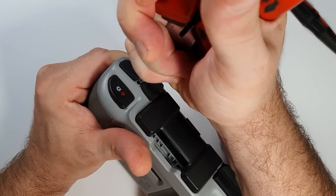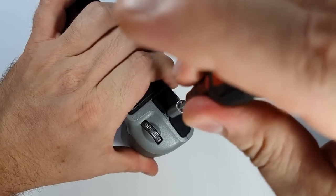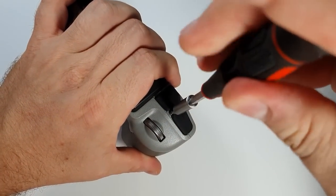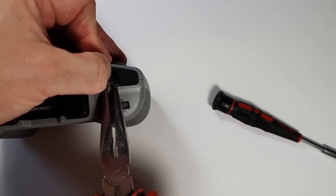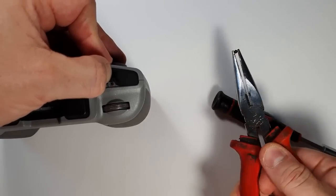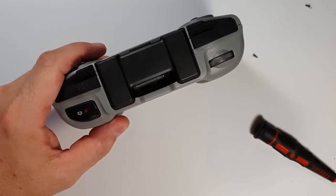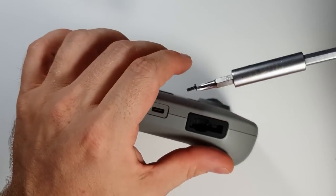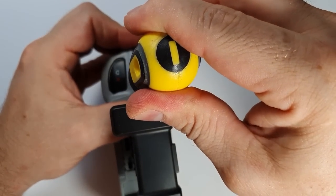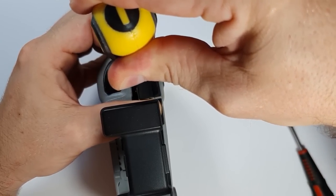I think it is just too loud. I don't like it. So this controller is held together by four screws. Two are under the rubber pads on the top of the controller. As you can see, these are rather hard to remove — they're very tight in there and the space is very little. I removed those and the two screws on the bottom, which were easy, and then started to pry open this controller. This is quite a difficult task I must say.